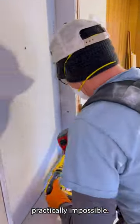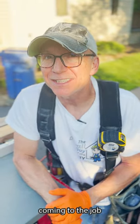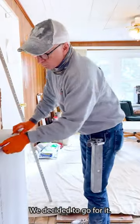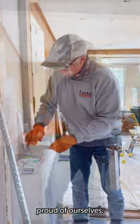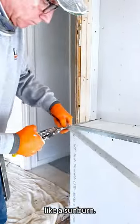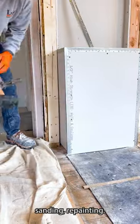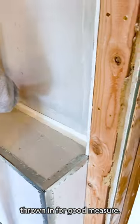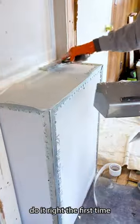Now any drywaller will tell you that's practically impossible. Something cool happened after the sheetrock was hung — I was very excited about my granddaughter coming to the job the next day. My boss was not one to back down, so we decided to go for it: slapping on hot mud, scraping the lap marks, and painting it as fast as we could. Got done late in the night, feeling pretty proud of ourselves. We strolled back the next day for a victory inspection, except victory quickly turned into defeat. The paint was peeling off like a sunburn. Turns out, rushing that mud job meant it was still wet under all that paint. So there we were, back to square one — scraping, patching, sanding, repainting. What should have been a one-day wonder turned into a three-day marathon with a whole lot of material thrown in for good measure. Lesson learned: don't mess with mother nature, especially when it comes to drying time. No matter the time it takes, do it right the first time, and you'll always be the victor.